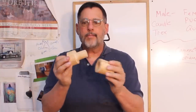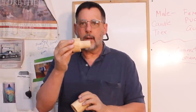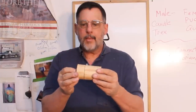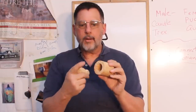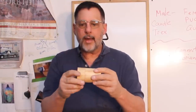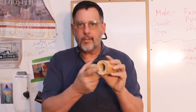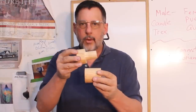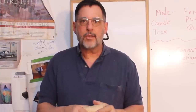This is a piece of honey locust — a male spigot or tenon — and the female recess with a little bit of a taper on there. Let's say that is a perfect fit; I've threaded it and it fits in there perfectly. I also need to talk about this flat area abutting up against this shoulder — that's important. Let's say our threads are loose; we've gone too far and our threads are like stripped. Here's what you can do: take a little bit off this flat area or shoulder and your threads will thread on a little bit more, and because it's tapered, it'll make a tighter fit. I aim for parallel sides on my threads.